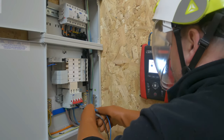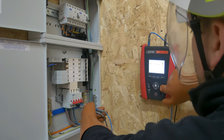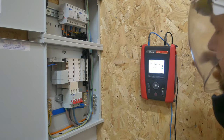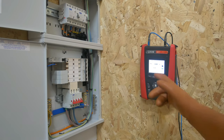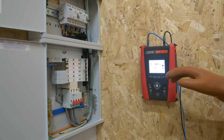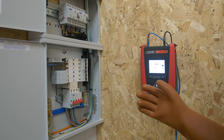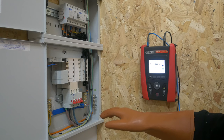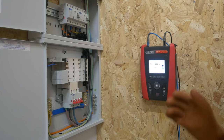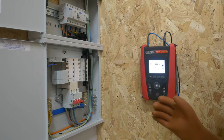And lastly on L3 — again we've got that input voltage at a single-phase level, and another similar value. Note that the ISC is much lower than between the two phases because this instrument does the calculation itself. So there's the rule of thumb within Guidance Note 3 where you would double your value — if you've measured this single-phase arrangement only, just line to neutral, you'd double that to give you an approximate PSC, which would be roughly 1.2 to 1.3 kA, which is above what we've actually measured, so it's erring on the side of caution with that rule of thumb.